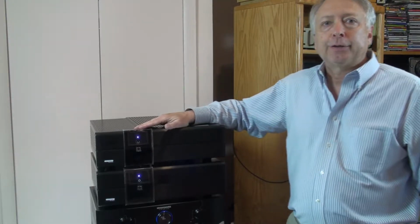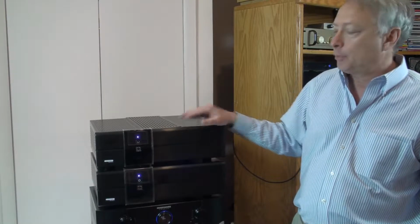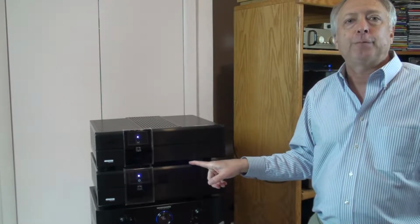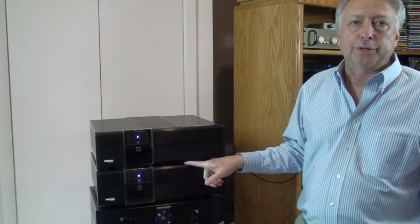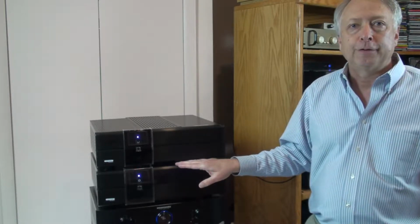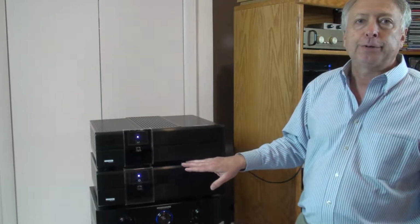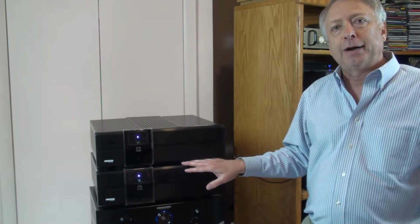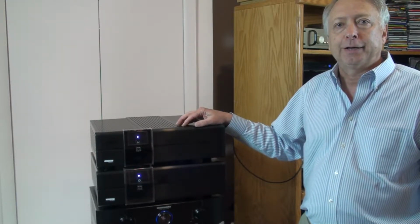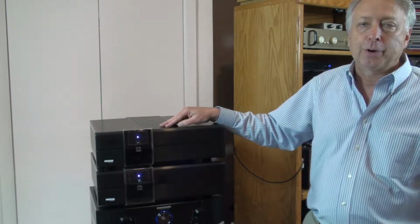So for higher channel count systems or systems that include overhead or height speakers, you have two options. If you want to use a single DP4000 IA, you can do up to a 5.2.2 system, or you can have more subs, make it a 5.4.2 system. The last .2 is the number of overhead or height speakers you're going to use. If you have a traditional 7.1 or 2 system and you want to add height speakers to that, then you can also use a second DP4000 IA, and that's your second option. With a second one, you can do up to 6 ceiling speakers or height speakers.